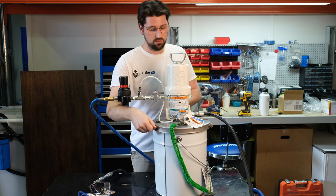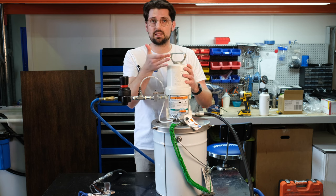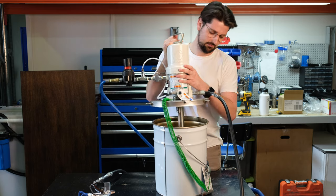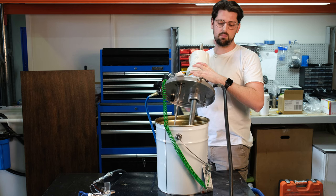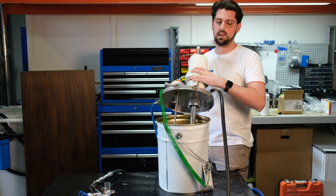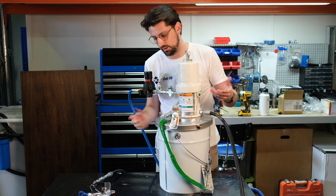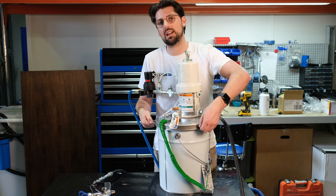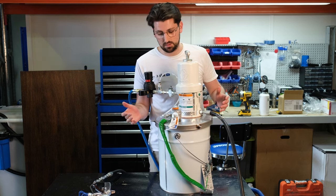Just loosen these out, spinning them anti-clockwise. The pump itself has a pretty easy handle — there's a little bit of weight to it, so make sure that you're lifting correctly with your back. You can remove the pump like so. We've got the bottom of the agitator that's in the drum, as well as the suction tube that's on the pump itself. That's all you need to do to refill, clean it out and go again. Get this lid back into position — you'll know because the lip of the lid will be going over the 20 litre drum — and just tighten the grub screws right back up again. Ensure it's nice and tight because we don't want any air leaking from the system when it's under pressure, as that will cause inconsistencies in your spray fan.